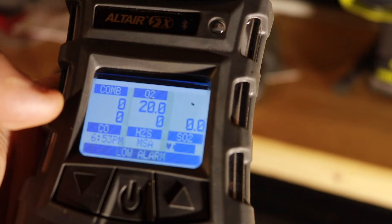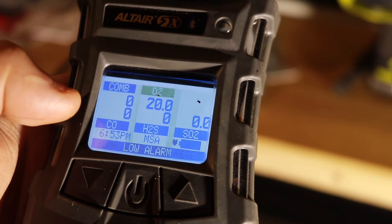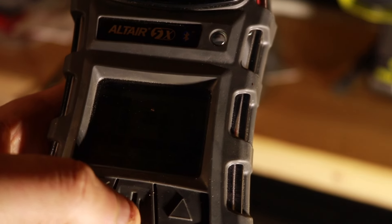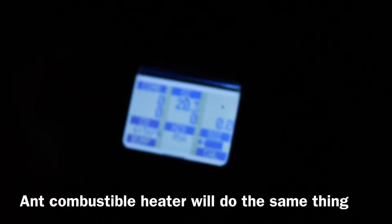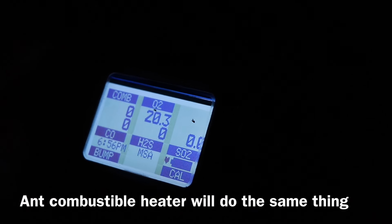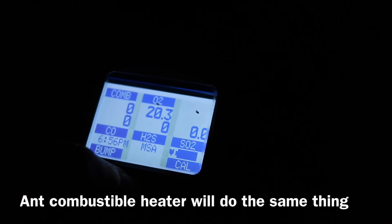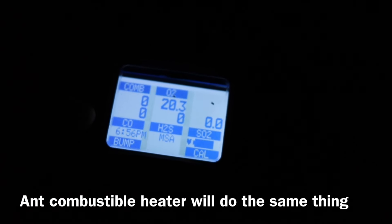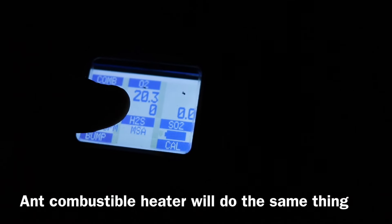Opening up the door — carbon monoxide levels drop but oxygen is still at 20%. We want 20.9%, so we're still at a low alarm while ventilation comes in. It should go off once levels recover. Long story short, we're still a little oxygen deficient. That whole thing took about two and a half minutes to hit 19.5%, and once it went lower it dropped faster — and that carbon monoxide went up, reaching around 35 ppm before the alarm triggered.